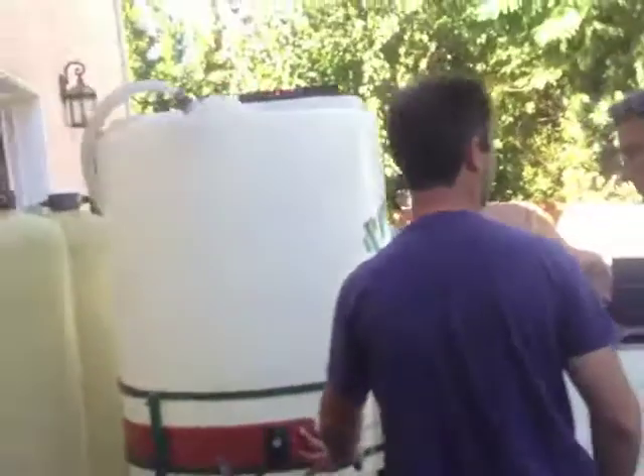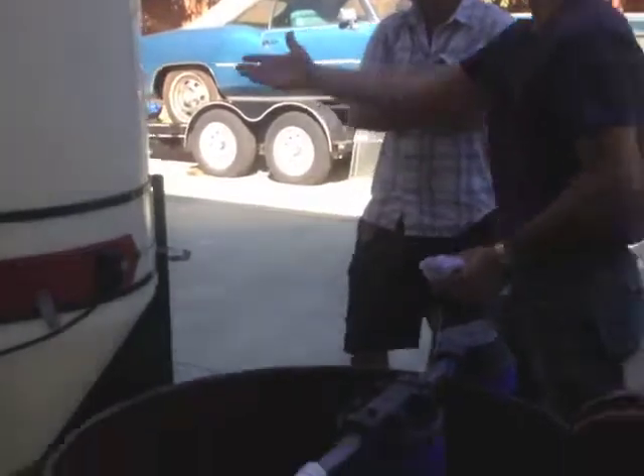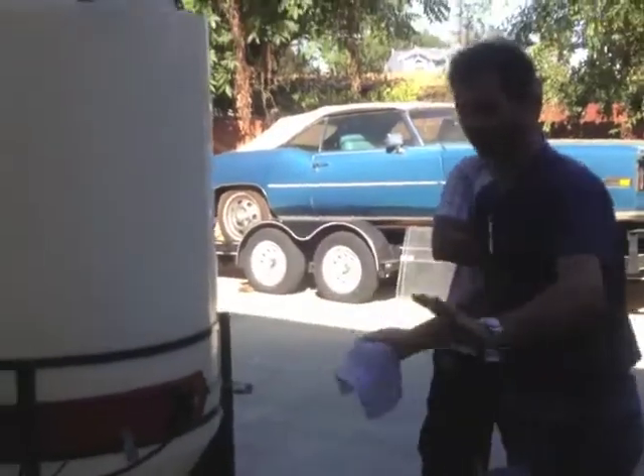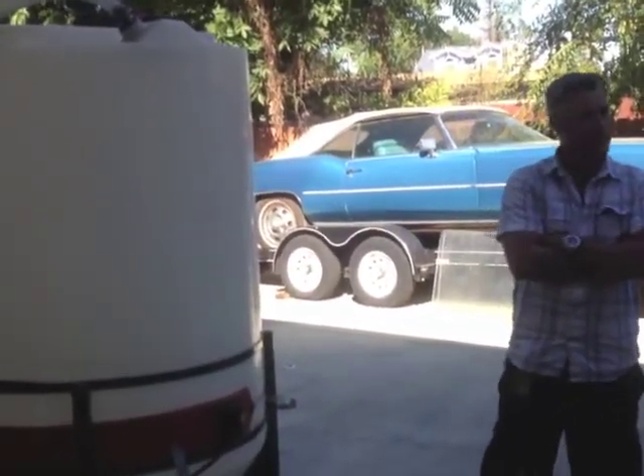This tank has a heater too. When I move oil from here to here, I keep this heater on so I keep it warm while I'm prepping. By the time I move that in, I will lose some temperature, so you want to try and keep your oils at 140 degrees, because at 140 you get a fast, nice reaction.